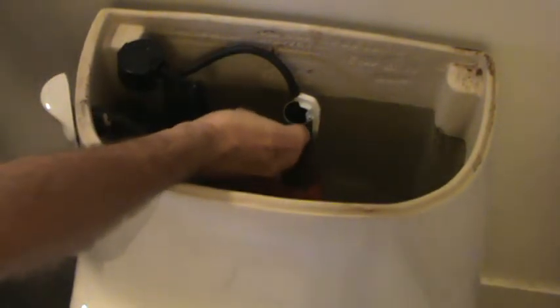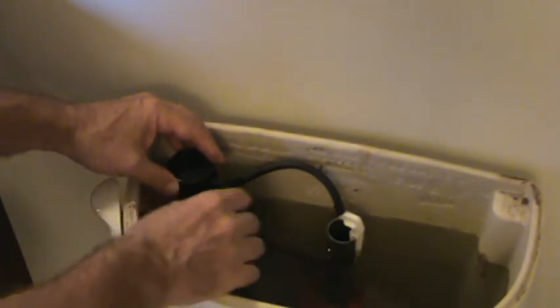And another way to adjust that is you want to make sure that this water is about 1 inch below there. And see, this one is about 5/8 or so. And I can adjust that too with this right here. On my channel, you can check that out. There's a way to adjust this. You just loosen the screw or tighten it, and that raises this ball up or down. Okay, so I want to lower that ball down a little bit, because I'm about 5/8 there. And I'm going to check it again.